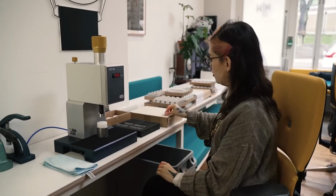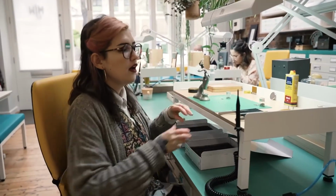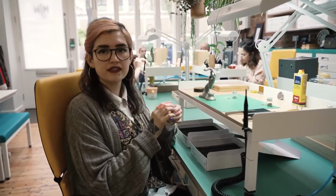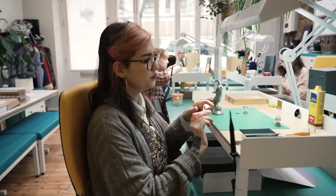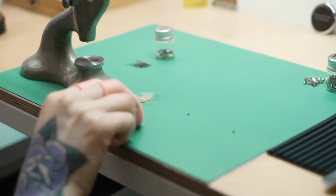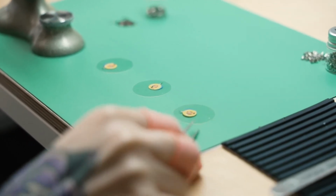After we have our glasses in cases, another part of our prepping process for each component of our watches is riveting. Riveting consists of putting a rivet, which is a hollow pin consisting of 2 parts, in the middle of our printed discs that serve in our watches as hands. So I'm going to do some riveting here of the hours for Perfectly Useless Afternoon. We grab our disc, printed print down, with our tweezers, avoiding leaving any fingerprints. We put the disc print down on top of the rivet. Push it down. The disc should fit in the rivet tightly, but not excessively tightly.